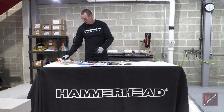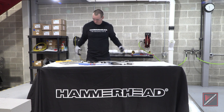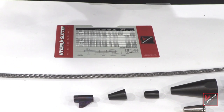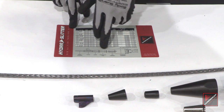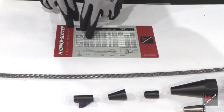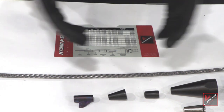If we do all that correctly, you'll end up with what we have here — your end product should resemble this tooling string. For this example I've chosen one of the most common setups here in Wisconsin: an existing lead line that's three-quarter inch in diameter being replaced with a one inch diameter polyline. First thing we're going to do before we assemble is take a look at the card, look at the image at the bottom, and get an understanding of where each component is going to end up. Then we take our pipe sizes, go down the left column, find them, and work our way right to pick out the individual components we need. I've already done that for us and everything we need is right here.